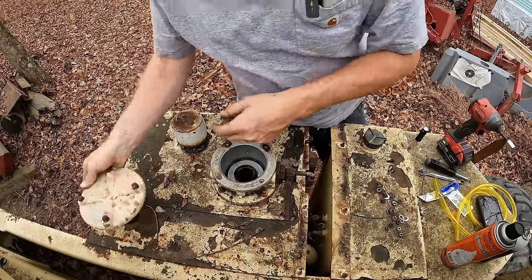Check this out. I thought I was smelling diesel while this thing was running, like raw, unburnt diesel. So I'm taking a look around here, and you see this is all wet back here. Yep, that's diesel. All wet back in there and everything. So I'm looking around. See that line right there with duct tape on it? Duct tape. That is the fuel return line. And she appears to be potentially patched up with duct tape. So yeah, we better do some fixing on that, I think.